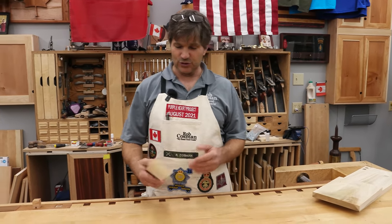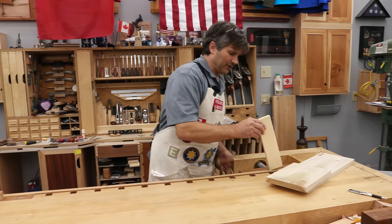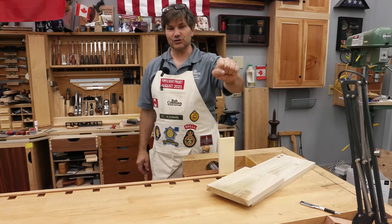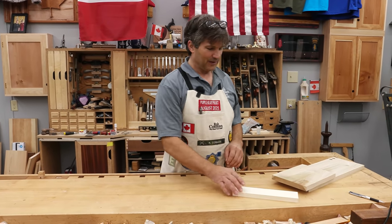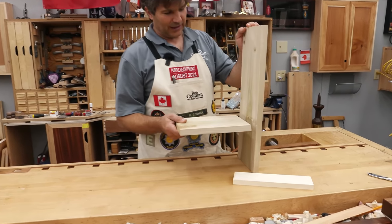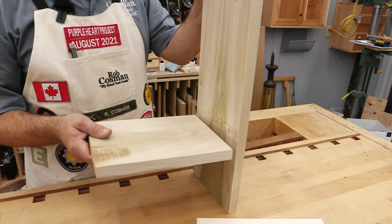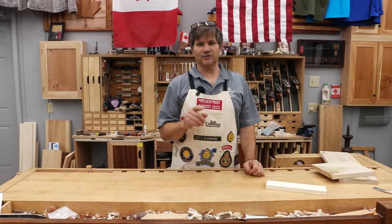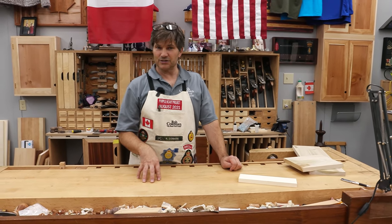We played around a little bit ourselves. We took two pieces of aspen and glued them together, left it overnight. Then one of the fellows here put it in a vise and pushed — it took a lot of force to break that. I don't think construction guys are going to start lengthening their two-by-fours by gluing them end to end, but it certainly gives you something to think about. I also took a piece of poplar and glued it as you would on a shelf in a case — it was extremely strong, though it didn't have the shear strength we're looking for. That is going to play out in how I'm going to make a change. I think the video was extremely well done — it opened up my eyes and it's going to make me make some serious changes to the way I currently work.